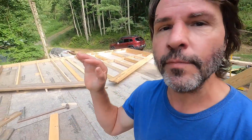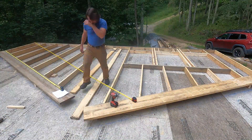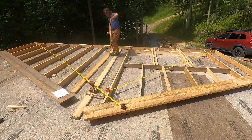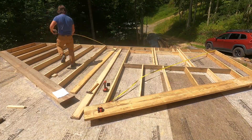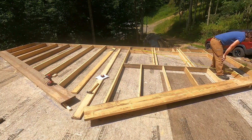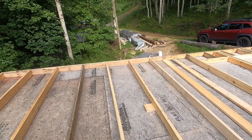I've been struggling trying to get it square because some studs are square and other studs are not square, and you can't just move everything over. I'm going to do a little time lapse of the process I'm going through to square everything up. I'm ending up having to square intermediate studs and then measuring off of the ones that I can get squared. I think it's probably partly the building being off just a little bit. My bottom plate needs the studs to be square off of it so that they will be plumb when I stand the whole thing up. Also, I'm sheeting this whole thing, so whatever state it is when I sheet it is the way it's going to be forever. If it's not plumb, it will literally be impossible to try and straighten out.